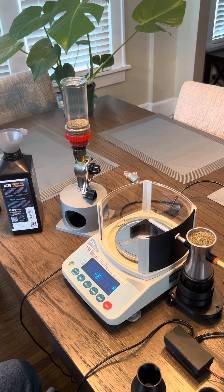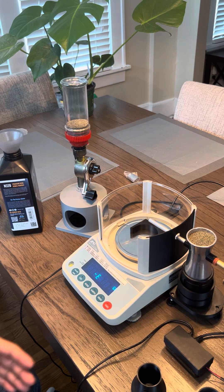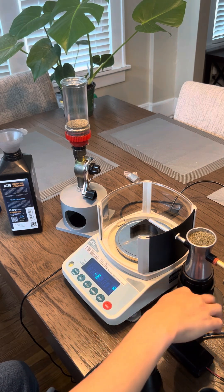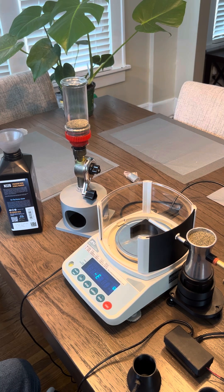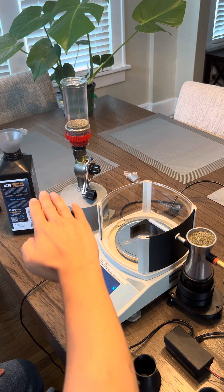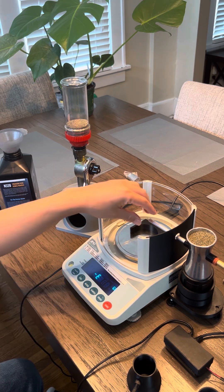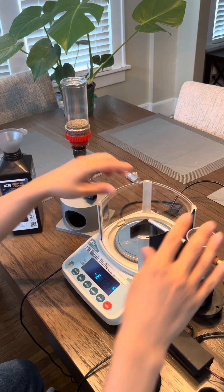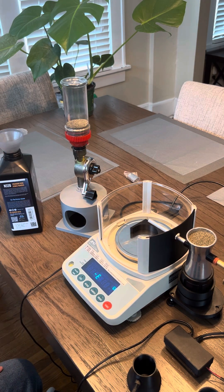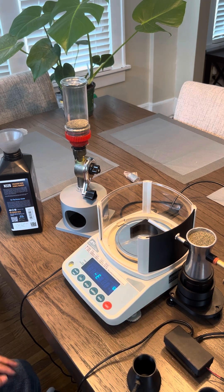Another issue was that the trickler has to be elevated in order to clear the cup, so I designed a modular base system. The trickler tube is also very sensitive to its positioning — too steep a downward angle and it will continually overthrow charges, but too gradual an angle and it'll throw accurate charges but takes forever.